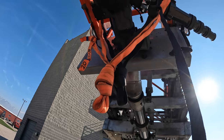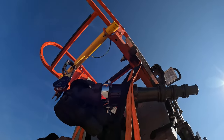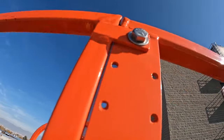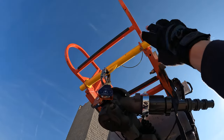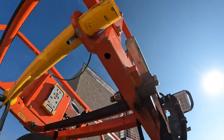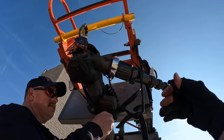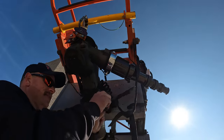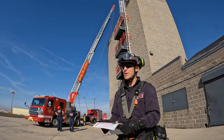You can see those bolts right there at the very tip. We don't want to anchor anything to the very tip because that's not part of the structural rail or frame of the aerial. Where we actually put our sling is further back on the frame — that's an important detail. Those bolts at the tip are not rated for this purpose.